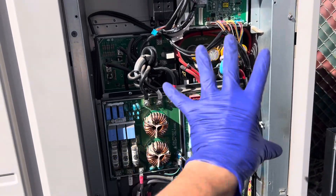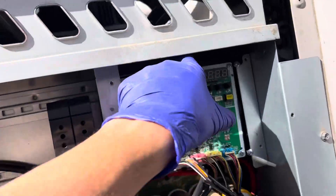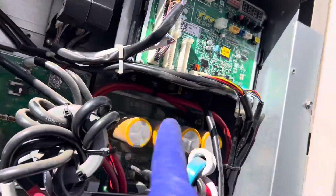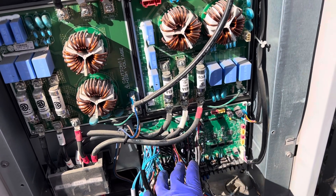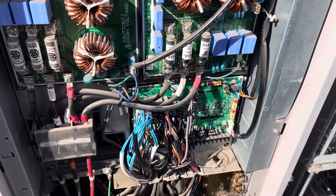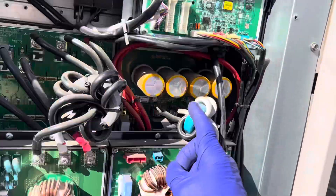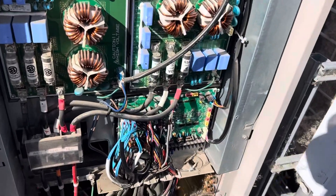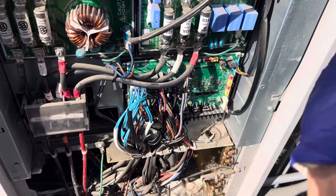No difference other than all your boards and everything are right here, not scattered throughout a whole unit. We just had a problem where the power board was corrupt, and it actually made the main control board test bad — gave the same symptoms. Even in the diagnostic literature it says replace the main board, but I had a sneaking suspicion it was corrupt power to the power board making it act up. Sure enough, I proved it by scavenging a power board out of another unit, and swapping it in made the main board work fine.